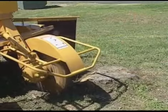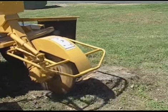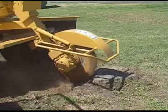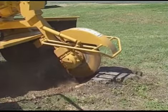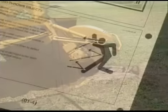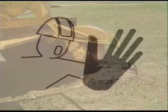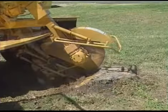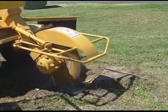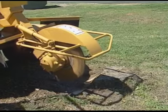As you continue the cut, lower your cutter wheel and make a deeper cut into the stump. Continue cutting the stump, lowering the cutter wheel after each pass before swinging it across the stump again. Heed all warnings on the machine decals. When you've cut into the stump approximately half the diameter of the cutter wheel, raise the cutter wheel and move it further into the stump.